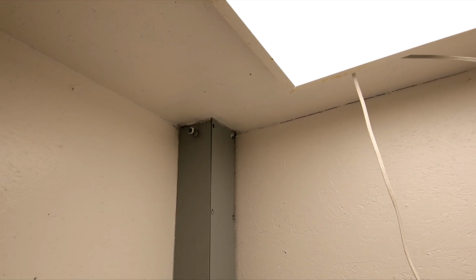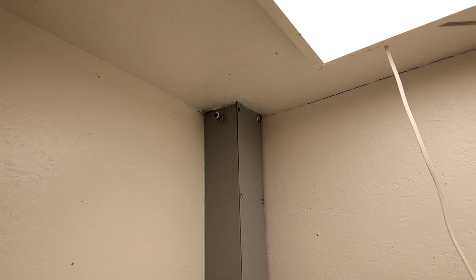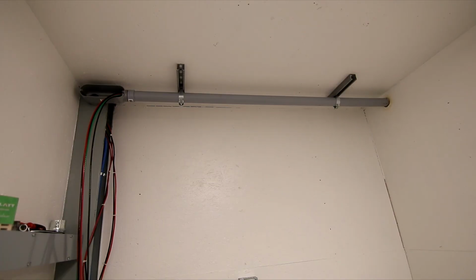And then from there I'm going to run some 2-inch EMT and then an LB fitting into the wireway. And then coming over here I will run a female adapter on the PVC pipe. That's where I'll transition pretty much at the wall. I'll have an LB on the outside and then run down into my trench. More as it happens. Okay, so we are back.